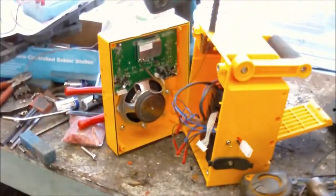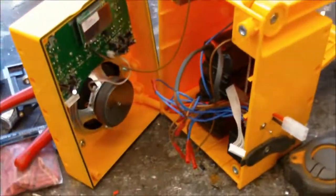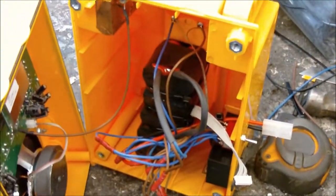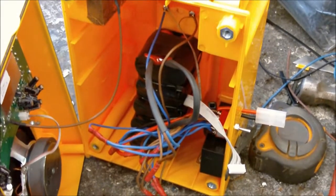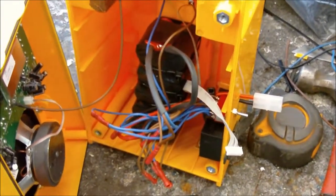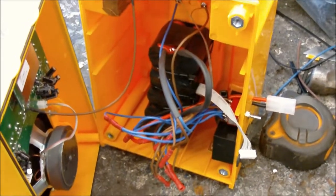Forgive the mess. This is the basic Denver with DAB tuning. This is the empty box when you prise it apart, so there's loads of space in there. These are two 10,000 milliamp-hour battery packs which I've made up — £23, I think they cost me. That's 10 amp hours, and if it uses even half, that's 20 hours per battery pack — but we'll see, because I'll test that out.